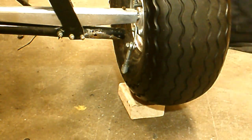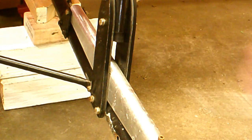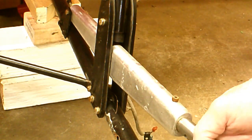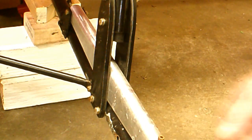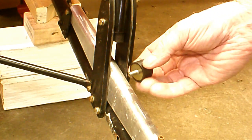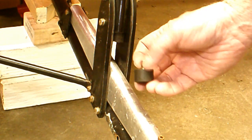It's got to hit pretty hard to hit that suspension stop. Right here, in the end of this down tube, that's the suspension stop — it stops this thing from going up too far. You've got about three inches of travel, and this stops this aluminum piece from hitting this steel piece. What's on there is a piece of rubber — it's a motor mount, a little vibration isolator. You can get them from probably auto parts stores. This one, I think, was made by Lord Corporation.